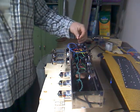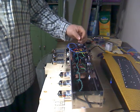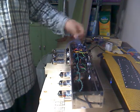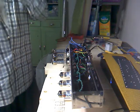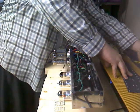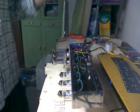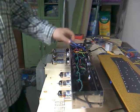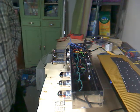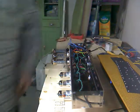This is one of the other taps you can use for 120-volt power on the Weber transformer. When I measured out of the wall I was getting about 123V, so when I hooked this one up I found that my power coming out of the secondary of the transformer was a little bit higher than it should have been. So I switched to the blue wire, which is the 125-volt tap, and that brought things down into the ranges where they should be. This transformer is one of the most common ones from Weber — it's used in tons of their kits like the Twin Reverb ones and all the bigger 60s Fenders. So if you find you're getting about 123 volts out of the outlet, you might want to try using the blue wire.